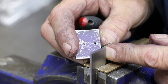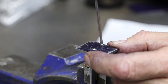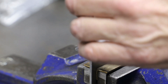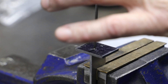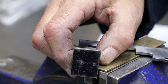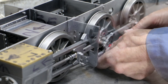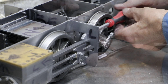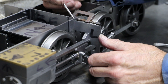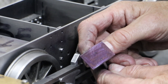The 10BA bolts I'm using to hold the bracket to the main body are only temporary — the joint will eventually need to be soldered. Ideally I would have used countersunk screws but I don't have any, so I slightly counter-bore the bracket to allow me to fit slotted head screws. This in turn allows me to fit the motion plate so that I can use the frame to mark the vertical dimension for the bracket. With the bracket marked accordingly, I can now file down to the line.